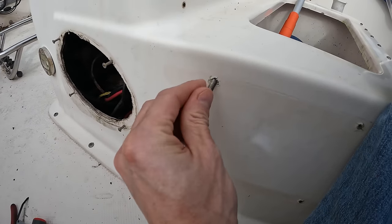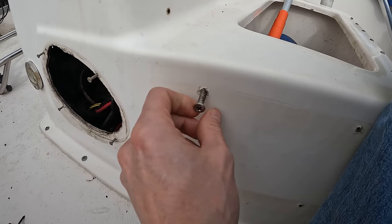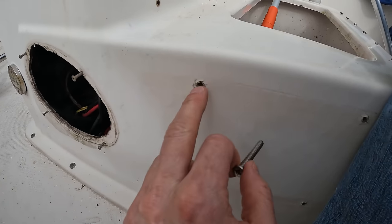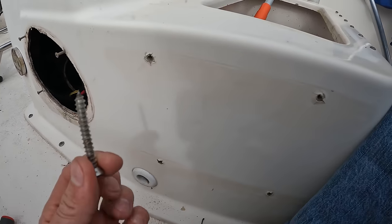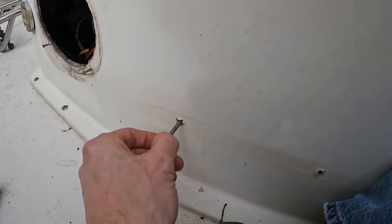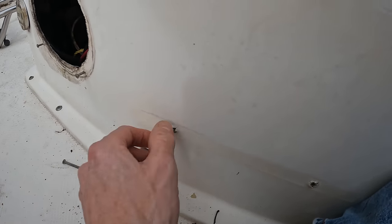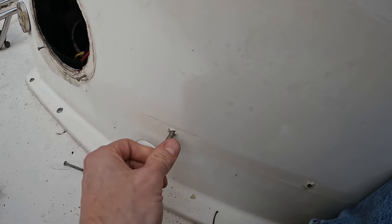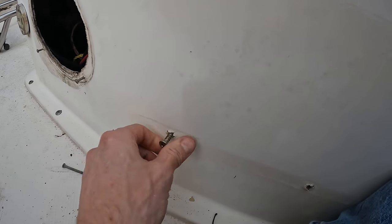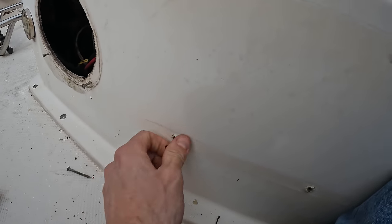The most obvious way is to just use a bigger screw. If you put a bigger screw in there it's going to hold a little bit better. You can see on this one down here that has already happened — it's already pulled out, but someone used a bigger screw and ran it in there, and you basically can't pull that out. So that's one way to fix it.